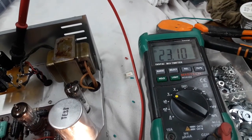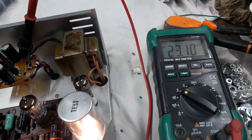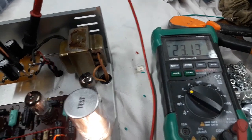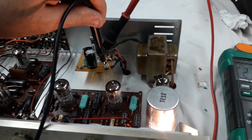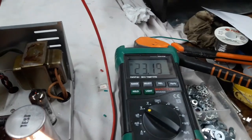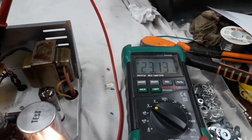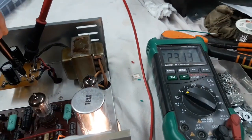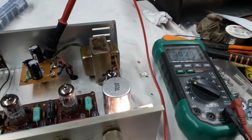That's perfect. It's getting a little higher. That's so good. Little higher than the original 11 volts. Right? That's perfect. So my new little board really works. How wonderful. I'm proud of myself. Just over 11.5 volts on each of the preamp tubes. That's a good score. Let's double check those high voltages we checked earlier.